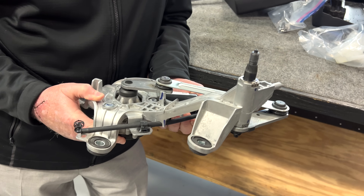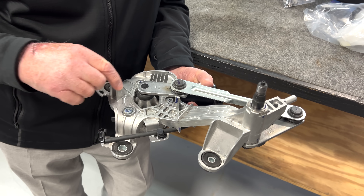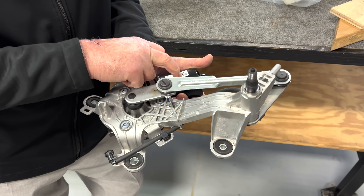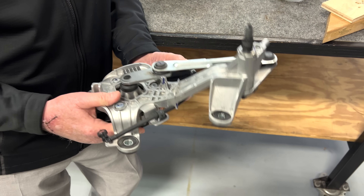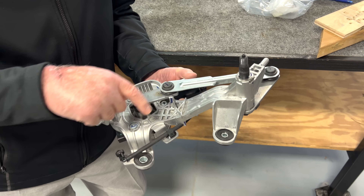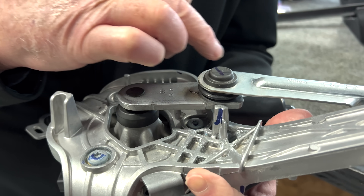So let's get on to what makes this work. These are generally termed a bell crank or a scotch yoke — there are a lot of different names for them. I can't move it because we haven't taken the electric motor off yet, but there's a little gear train in here. The motor is small because it's 48 volts, and it goes into a worm gear which powers a bigger gear.